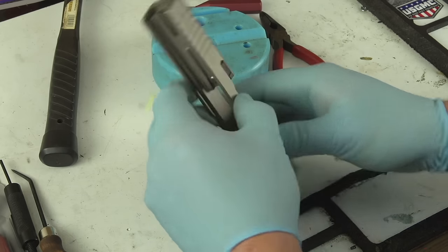Take the barrel and guide rod assembly, which is completely captured, and replace it. And we're gonna reassemble the pistol and perform a function test. Line up the cuts in the slide with the recoil bearing surfaces of the frame, the slide rails, frame rails. Cheat it back, all right, and you'll see your disassembly notches kind of push up and hold everything in place.